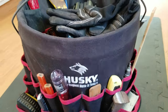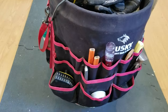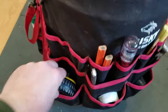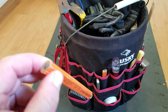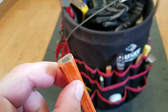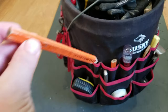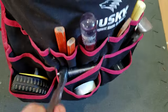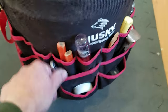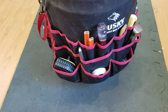I'm going to go around and show you what I have. Got a chalk line, pretty standard. Carpenter pencils — I always have more than one so I don't have to look for them. Usually I have them sharpened on both ends: one end is a sharper point for finish work, and the other end is coarse for marking OSB or other stuff. Got a 3/8 ratchet for nuts on carriage bolts, lag bolts, or whatever.